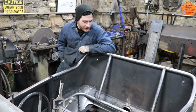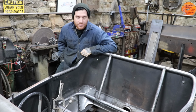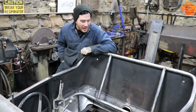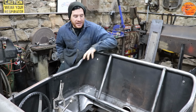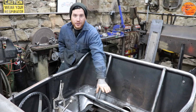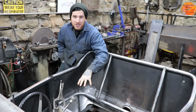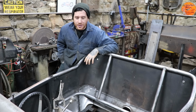And we're doing hopefully one of our last little updates to this redesign we did for the rear hoop seat section of the body. Pretty happy with how everything came out. The last little update we did, we got the last of the bars all final welded in. We got the sheet metal for where your legs would sit for the seat notched down about 1.5 to 2 inches, so that's gonna get us dropped down, sitting a little bit lower.